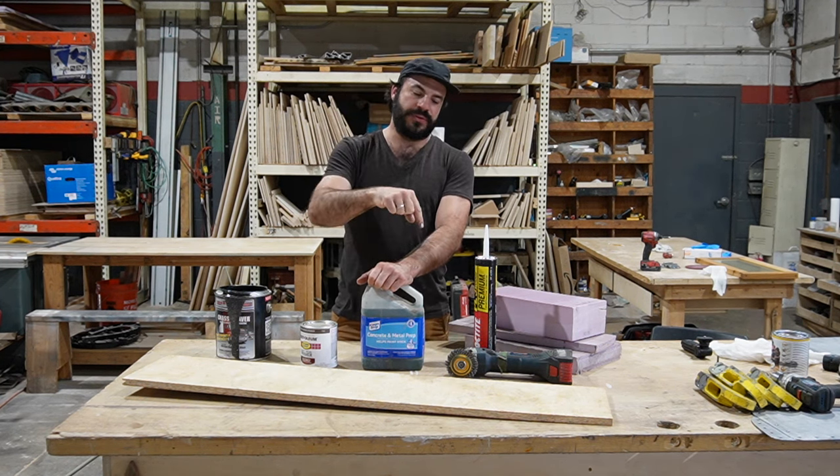And like I said, I measured our distances off the wall there and into this seam. So I had 8 1/4 off the wall, 4 1/2 off the seam, lined up those edges, and then I traced this whole thing. I'm gonna grab the skill saw and I'm gonna set my depth of cut to this. I'm gonna make what's called a plunge cut and cut this out, finish the corners with my multi-tool, and I can remove this, and I'll already have my patch ready to go. Like I was saying, it's easier, in my opinion, to cut a hole to fit your patch than to cut a patch to fit the hole.